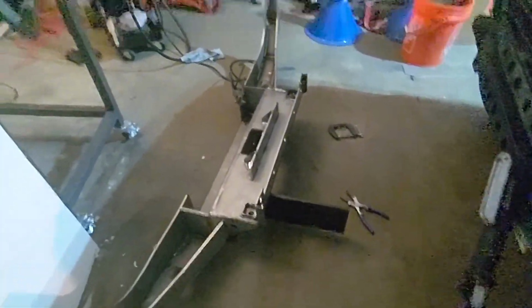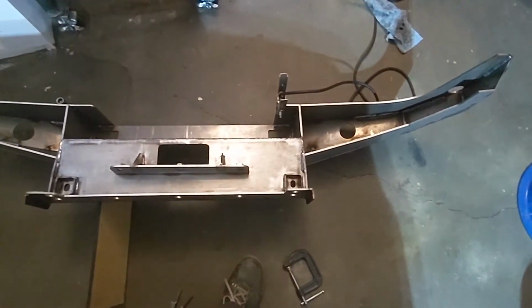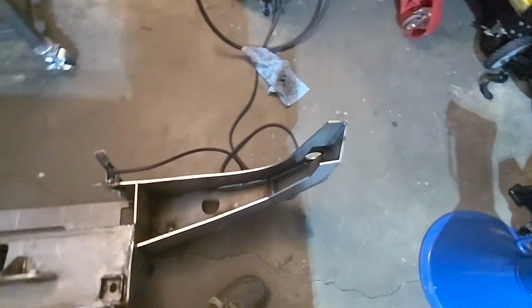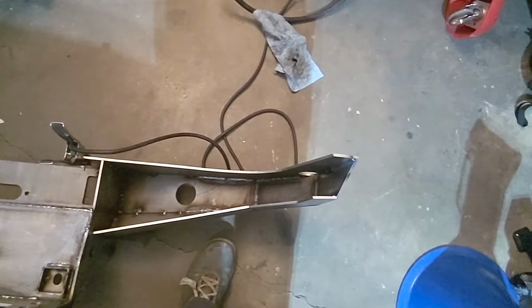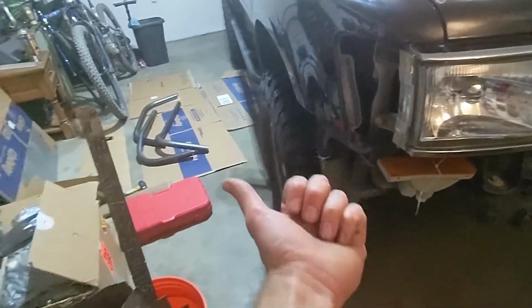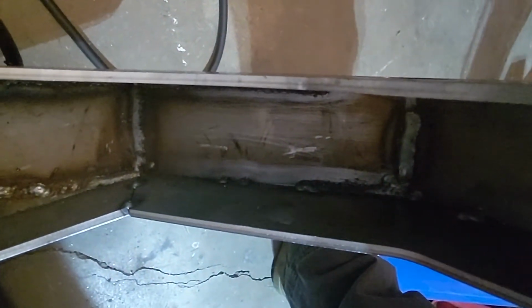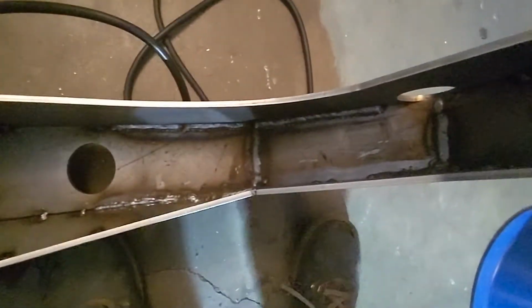Sorry, you can hear the compressor draining in the background. So, we got it off the truck, this side. The passenger side, that I had to pull out this way, I ended up putting a ratchet strap to my engine hoist, pulled it out, tacked this in there, and it still had a gap, but I can weld a gap. So you can see I've started welding through it.